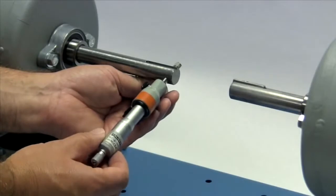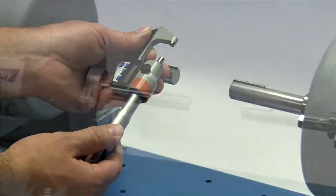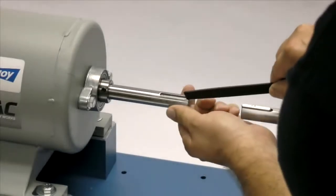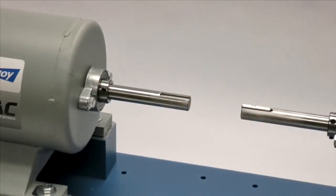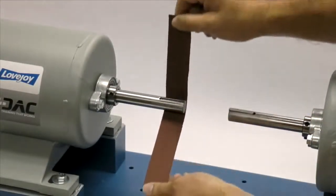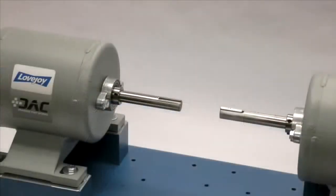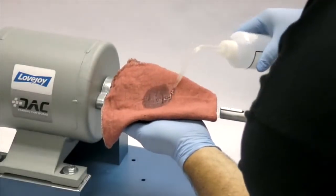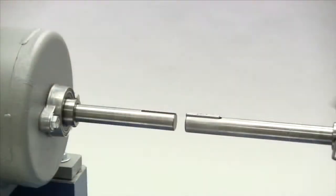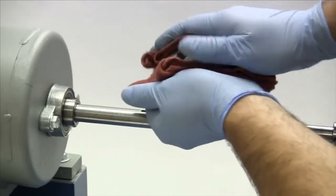Measure the shaft and ensure that the shaft diameter matches the coupling bore size. Then inspect the shaft and clean off any nicks or burrs from the keyway or shaft diameter. A fine-toothed file can be used to clean burrs from the edge of the keyway or large dents in the shaft. The emery paper can be used to clear the shaft of rust or any fretting corrosion. Finally, using our cloth and cleaning solvent, ensure the surface of the shaft and the keyway are clean and free of dirt. The hubs, the grid spring, and the cover accessories should also be cleaned to remove any coatings used to protect them during shipping.